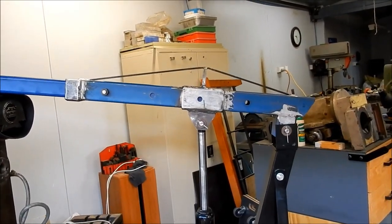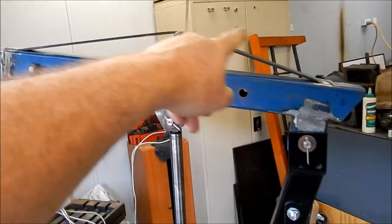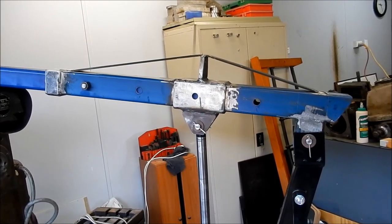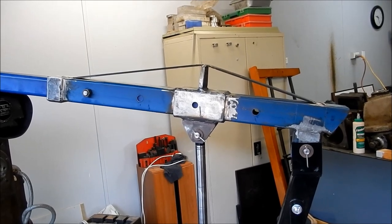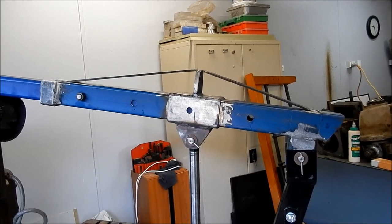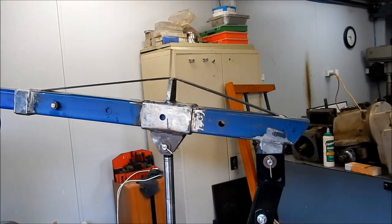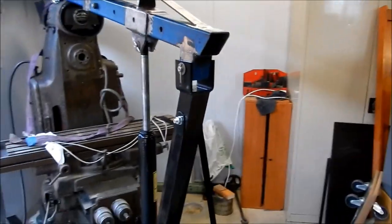I did run some numbers on this telescoping member - without the cord on it, without the truss, it worked out around about 200 megapascal of stress. It's 300-rated steel so we're under that. It certainly doesn't meet code - nowhere near it actually - but for my little workshop here, as far as the safety factor goes, I'm only lifting things a little bit off the ground, so it's fine. Certainly wouldn't meet code and wouldn't be able to be used in industry.